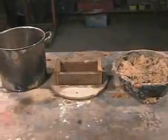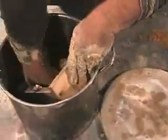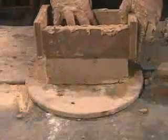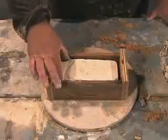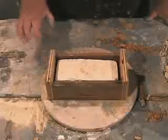Make wooden or metal molds and fill them with the clay-sawdust mixture. Wet the mold to help the bricks slip out of the bottom. Fill the mold, pushing the clay into all corners. A block of wood can then be used to push the brick out of the mold. The wood can be removed later when the brick has hardened. Here is the fired brick — it has reduced in size as it was dried and fired. After a bit of experimentation, lightweight, durable bricks can be easily made.